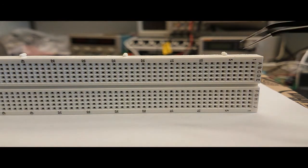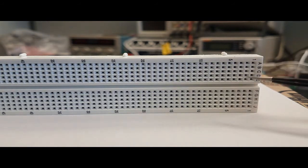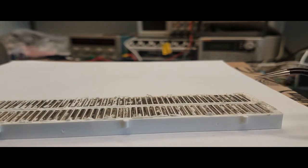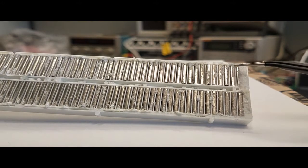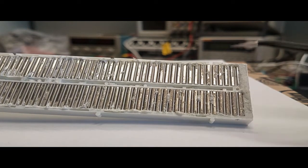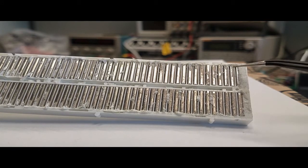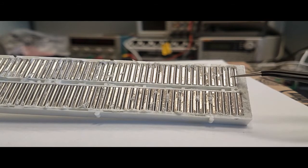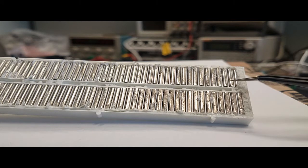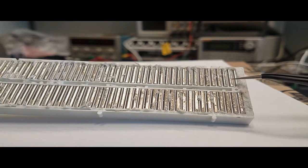Something worth knowing is that each pair of adjacent columns represents a capacitance, because capacitance from basic physics is two parallel conductors separated by an insulator — which is exactly what we have here. One column is one conductor, the adjacent column is another, with a very small distance between them. So any two adjacent columns represent capacitance.